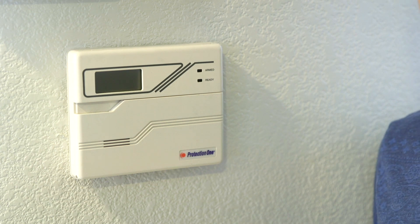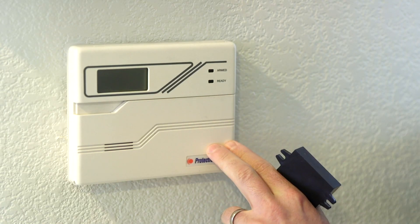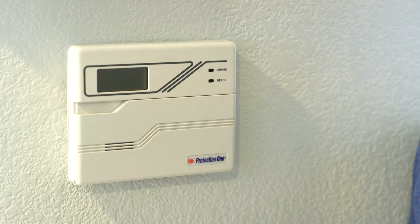Now I'm going to show you how you can replace your old alarm system keypad. It's actually really easy to do — it's only going to take you 10 minutes. All you need is one of these 12 volt USB converters. I got this on Amazon for about $8. The wiring in your wall for your keypad is already suitable to power this USB charger so you can wall mount your tablet and have it powered all the time.